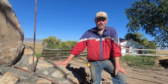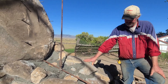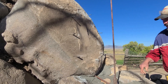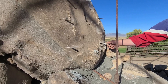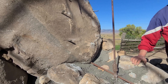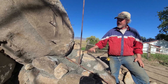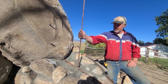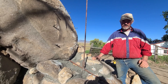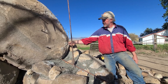We also harvested a lot of sweet corn today, so we stopped by 9:30 this morning. Now, about those little steel pieces in the rocks — I took a diamond saw and cut into the rock, then took a piece of steel and stuck it in, all the way through the foundation. I'm stepping on one right here. That just holds the stone wall to the larger foundation rocks — same idea as the rebar, just something that holds it together. Reinforced concrete works better than unreinforced, so we reinforced it. I had to pound them in with a hammer.